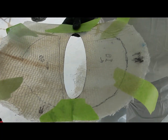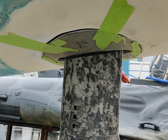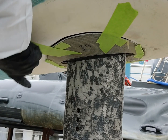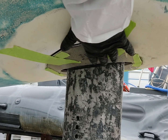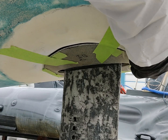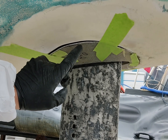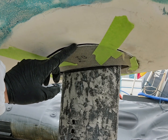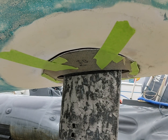Just going to make a fiberglass housing first. I took a splash off the back of the hull here and carried that through to here. This fiberglass plate — I split it in two and cut it with an offset around the sail drive, so this will fit flush with the hull with the rubber boot inside, so it's reasonably watertight. I've got to now make a fiberglass ring that'll go up inside here a little bit, get bolted in place, and then once that's bolted — probably a little bit of glue — this will bolt to that flange to keep it all firmly in place. But it's completely serviceable still.